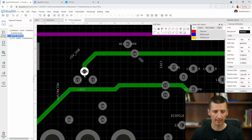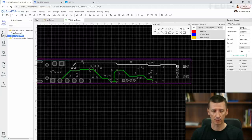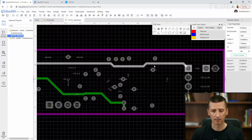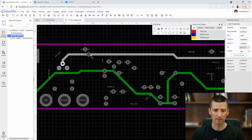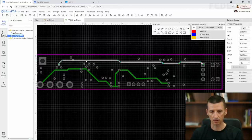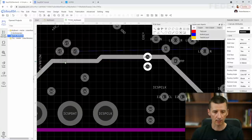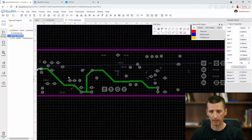First, select this plus V in, press H to highlight. We would like to see what we need to connect these vias with this path which is here, and also think how you are going to draw this copper area. Think about the space between the vias. You would like to be sure there will be enough copper going between these vias. So I'm going to unhighlight this, delete the existing connection, and move this a little bit so we have enough space for drawing the copper area.